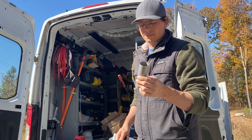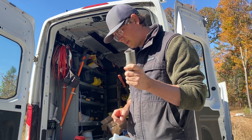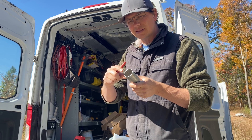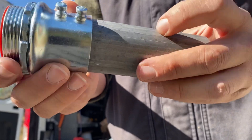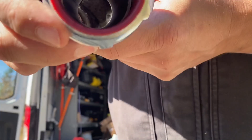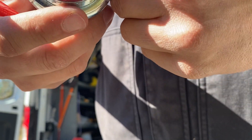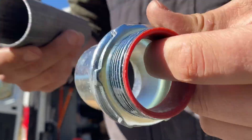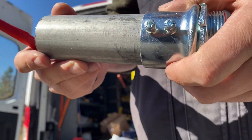The Solark is going to sit 6 inches off the wireway, so I'm going to cut all these nipples at about 5 and 3/4 inches. There's a little bit of play on the fitting and you're going to want that, because nothing's ever going to be perfect. You need to make sure both set screws engage the conduit. If you can still move it just a little bit, you want that adjustability — so I always go just a little short on my nipples so it all fits in the end.